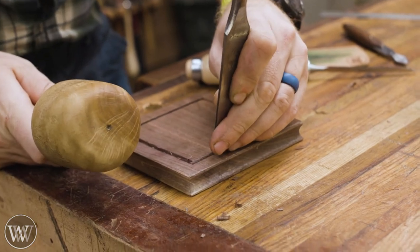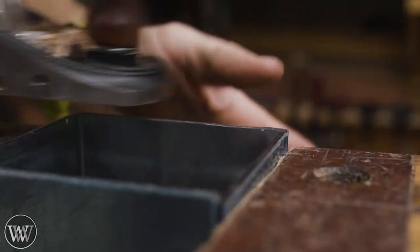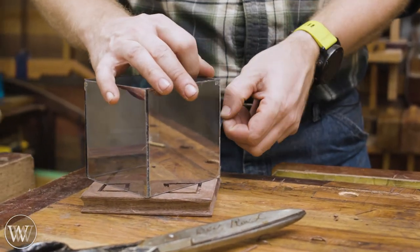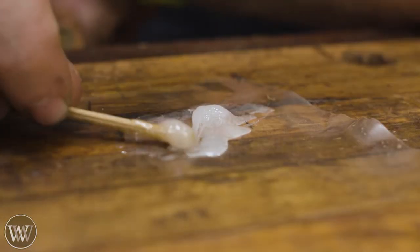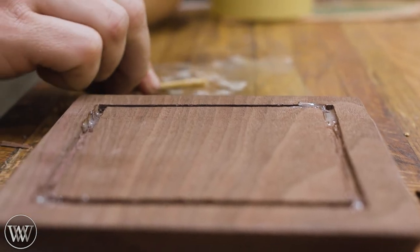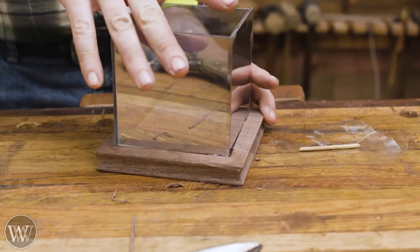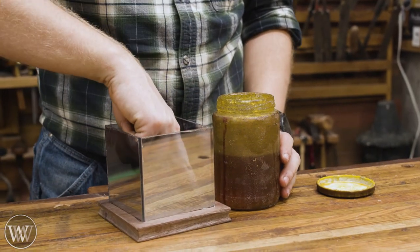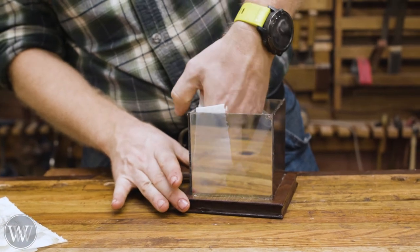Then we can get to the gluing. Here I'm actually going back and trimming it up a little bit wider so that it fits down. The planing sounds really good, works really well — plexiglass is a nice thing. Before gluing it in, make sure you remove the plastic because you don't want that stuck in there. You probably should also finish the wood before gluing it in, but I didn't think about that until it was too late. For the actual adhesion, I used a little bit of five minute epoxy worked into the grooves, trying not to get it on the outside — though I did in a couple spots. I was rushing at this point because of a time deadline, but next time I would take it a little bit slower. Slide it down in and let that epoxy seal it in place. It's not going to have a whole lot of pressure, so there's no real reason for the epoxy to be incredibly strong. I just used a couple of lightweight clamps to hold it in place. I realized I maybe should have finished it before putting it together, but it worked pretty well.